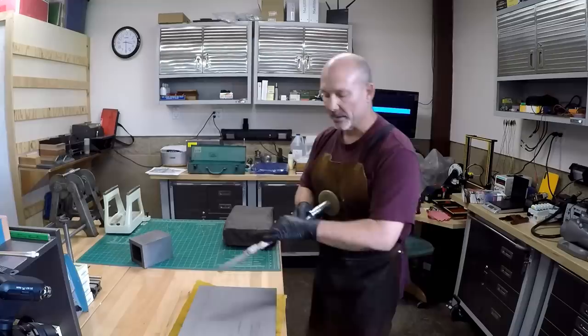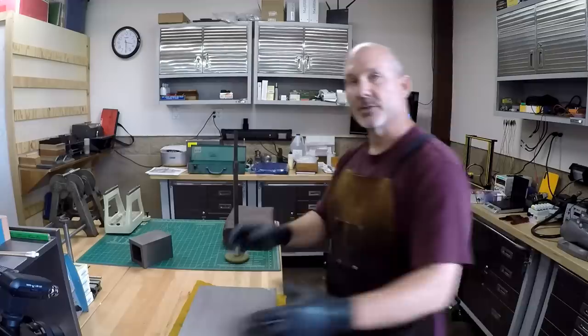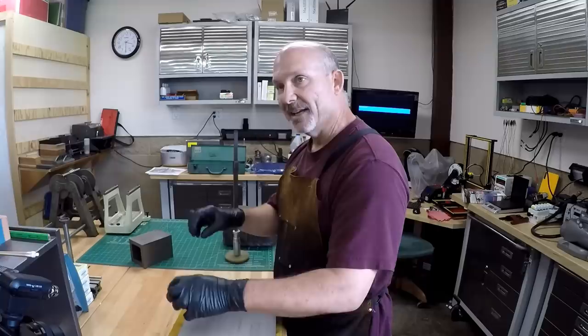This was one of the plates we did on the shaper this weekend. Typically you would take a part like this with some wear somewhere in it. You would take it to a granite surface plate or bring a reference device to it, and you might use shim stock or feeler gauges to figure out where all the wear is.